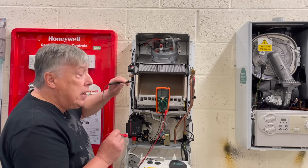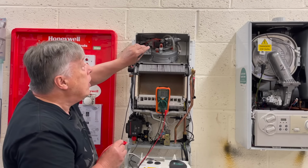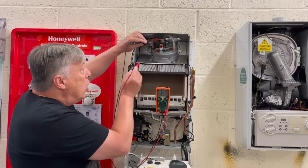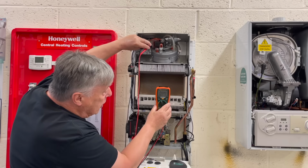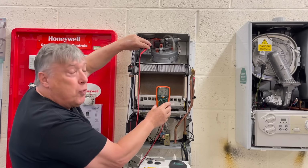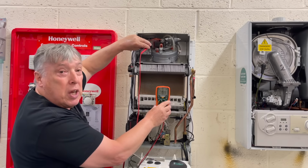So first of all, it doesn't matter which terminal you use, but use the holes up here. I'll do you a little close up. So we use that hole there and this hole here. And now we can see on the display, it's 44 ohms, 0.5 or 6. Now that movement, we don't take any notice.